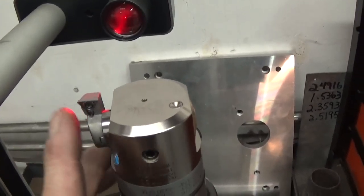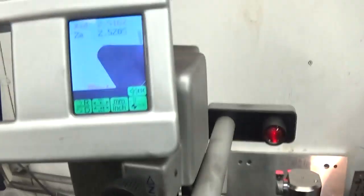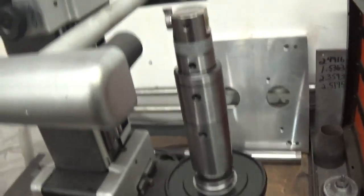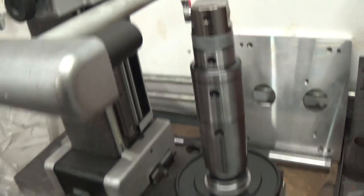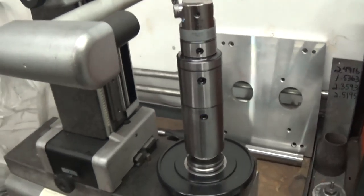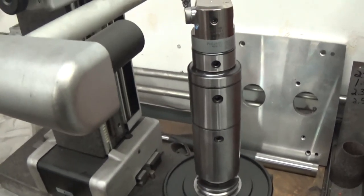I use a real high positive insert here — it gives a real nice finish. This is my tool setter. I've got it set to cut about 517 and a half, which will leave me two and a half thousandths for a finished cut. Now that the block's centered up, I'll put my boring tool in there, take one cut, measure it, and dial in another two and a half thousandths for finish. It cuts the same diameter top to bottom and does a really nice job.